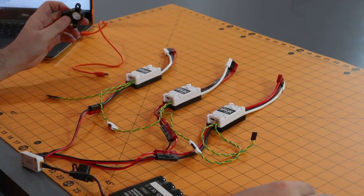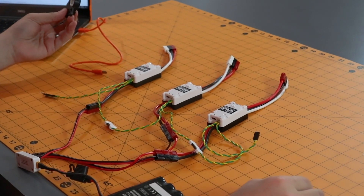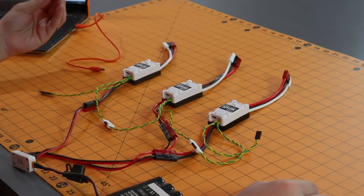The first feature is the introduction of alternate encoder. What that allows you to do is use an external encoder plugged into the top of your Spark Max. The most common utilization is when you're using a Neo brushless motor plugged into Spark Max — you can now have a higher resolution encoder on your drivetrain so you don't get as much backlash feedback through the gear train and you can do a lot tighter closed loop control.